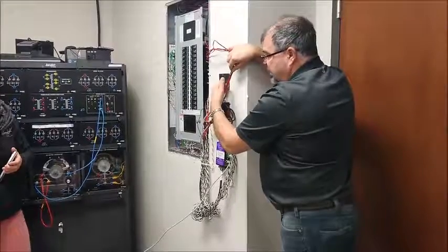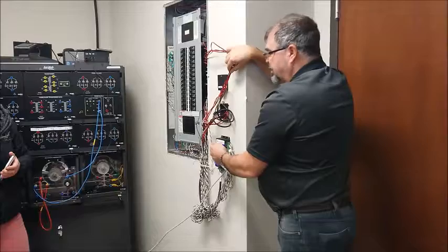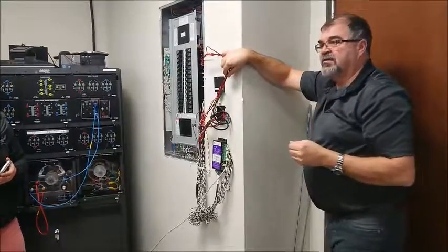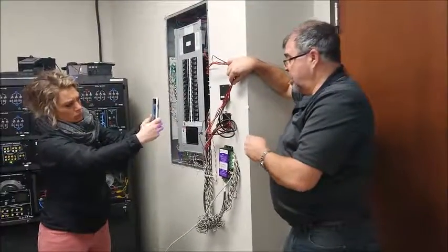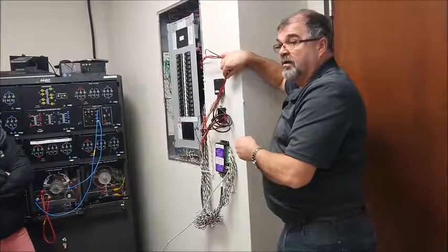This thing here is a residential version, a little bit more homeowner. It's not as friendly. It doesn't work in here very well. We've tried it. The reason it doesn't work is that it's not meant for a three-phase system. It's meant for home energy auditing only, and it's meant for a single-phase system. And it does not have a lot of the features that I was led to believe that it does have.